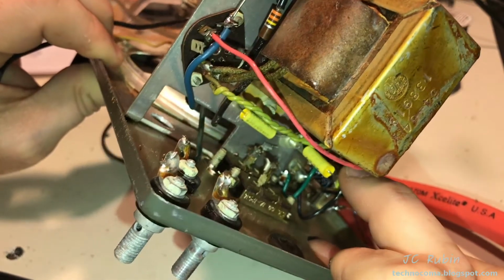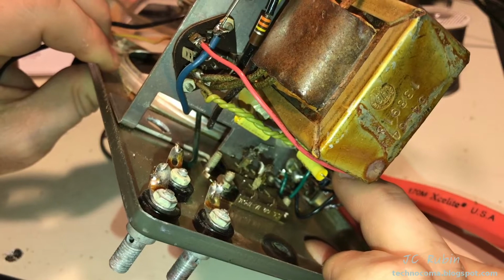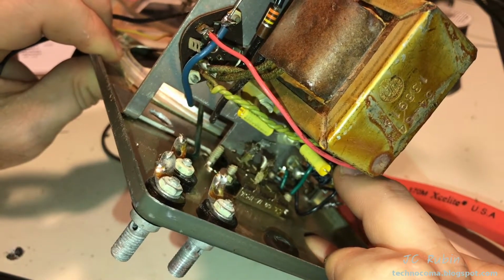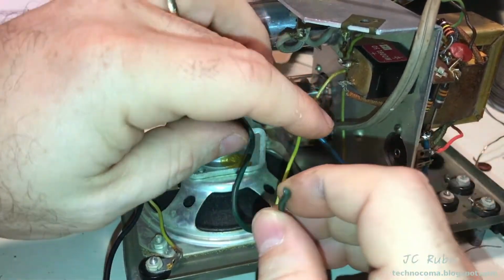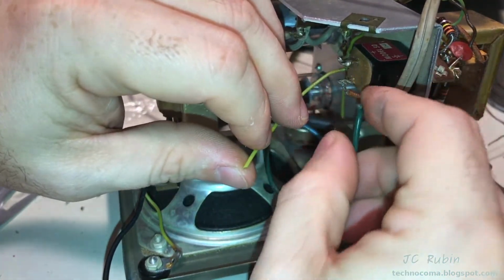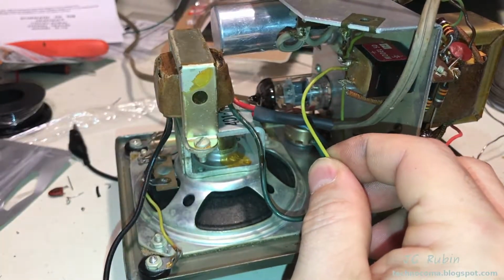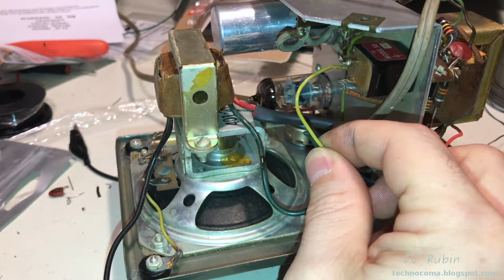But that brings us to another discussion, because power was a 2-part switch in the old system. We're going to short one connection together and make it a 1-part switch. It's just going to be AC now. So the second half of the power switch connects the green wire coming off of this audio transformer to the rectifier right here, the diode. And so I'm going to bring these together like that, and that should satisfy switch 1B, that requirement.